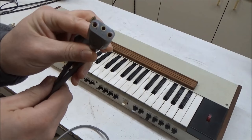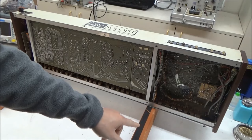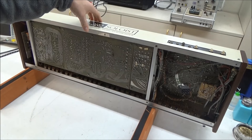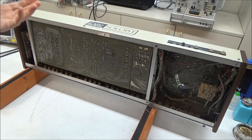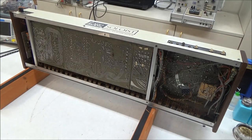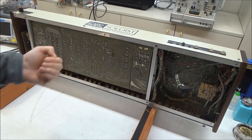I'm not just going to plug it in and fire it up — I'm going to be cautious waking this guy up since he's been asleep so long. I've taken the bottom panel off and have the synth propped up on a couple of 2x4s. It's not super stable, but this is the most serviceable position for this synthesizer. I can plug in a power cord, an audio cable, and access all the keys, switches, and controls. I can access the bottom of most circuit boards, and if needed lower the rack to get to the tops. Over here we have access to what I was really trying to get to: the power supply.